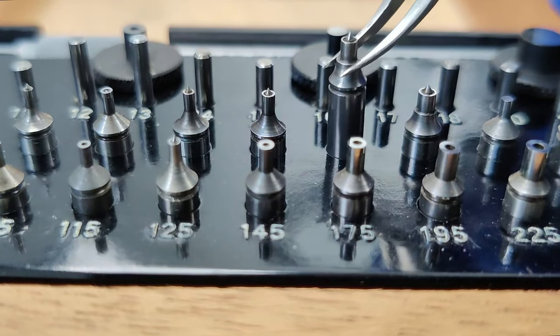Since this is a high friction area, applying DX grease to the yoke where it makes contact with the setting lever. And we'll get the reshaped setting lever in place. I reheated the setting lever and quenched it in water to reharden it. Screw it down here before we test it out. And there we go. I can easily grab the tab with my thumbnail now.